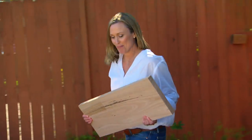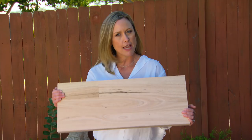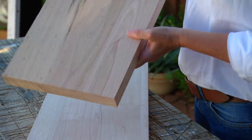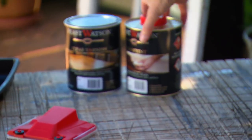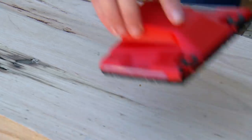What's really great about this project is I have a nice big room to work with. So what I want to do in the middle is create a room divider — and I don't want to use one of those flimsy folding screens. I want something solid and substantial. The plan is to do base cabinets like flat packs with a nice big bookshelf on top. For the shelves, I want something heavy so I've gone for a hardwood. You could use this just natural, oil it, or lime wash it — but I want to go for something really dark to tie in well with that red brick, so I'm going for a proof tint in a beautiful deep brown-black.